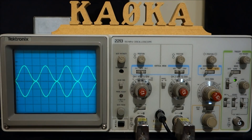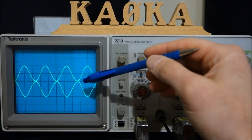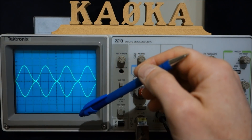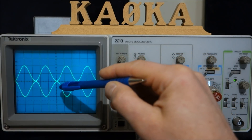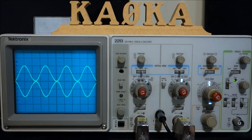We did not move the calibrated voltage settings. This is one side of the transmission line, and this is the other side. We have the carrier representing about plus and minus one division on one side and plus and minus one division on the other side of the transmission line. The key performance check for balanced operation is determining whether you have the same voltage on both sides and that each signal is 180 degrees apart from one another. When they are 180 degrees apart you get essentially zero radiated power through the transmission line — the signal goes where it should, out to the antenna, not radiating and causing problems in the near field. This is a good experiment to look at the entire antenna system. Looks good.